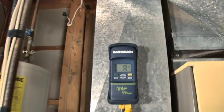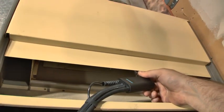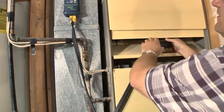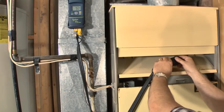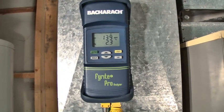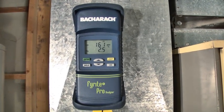I'm over 100 parts per million here. This burner right here has an issue — it definitely has a problem. Very high, considering 100 is as high as we go. It seems to be jumping around quite a bit. Let me get the probe in there good. Still above — definitely above — some work needs to be done on that one.